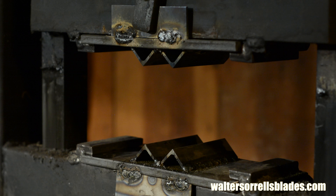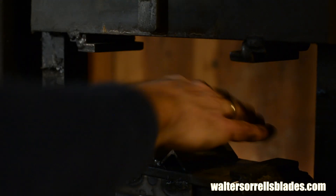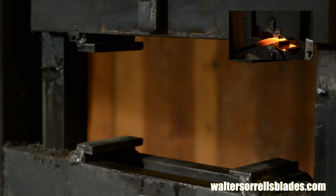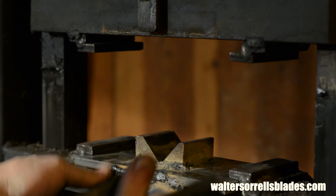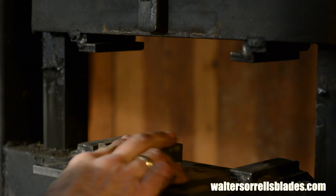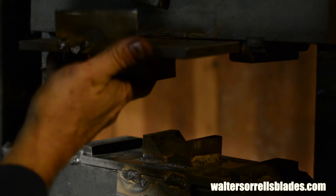Incidentally, this video is a follow-on to a video I made recently about making ladder Damascus dies. I'll be skipping over a couple things that I showed in more detail on that video — if you haven't seen that one, you might want to check it out first. It's helpful to have multiple sizes of squaring dies to handle different sizes of billets, so we'll make two: one with one-inch square dies and the other which makes roughly one-and-a-half-inch squares.